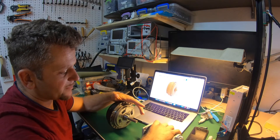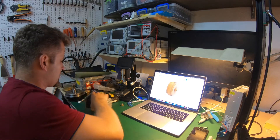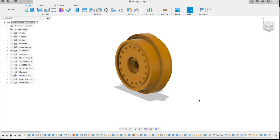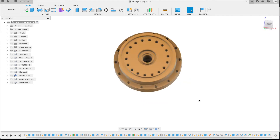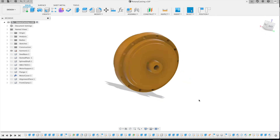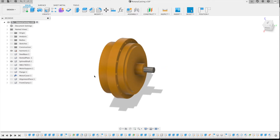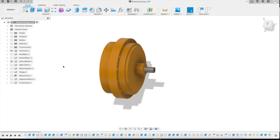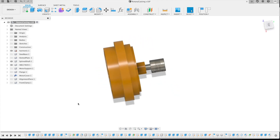Now I'm going to show you how I've made the CAD design for this. Here is how I imagine the fourth axis based on the epicycloidal drive. First, I've modeled the drive one-to-one so it has exactly the same holes and dimensions as the real one. Then I'll add the spline shaft that will turn the input, and a coupling. This coupling is just for modeling purposes — I'm going to see what I can find at local stores.